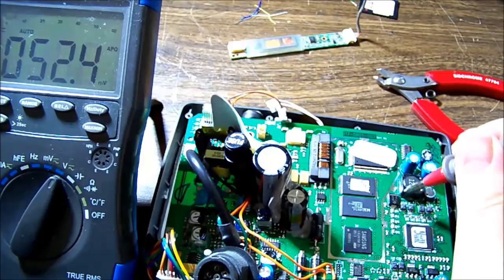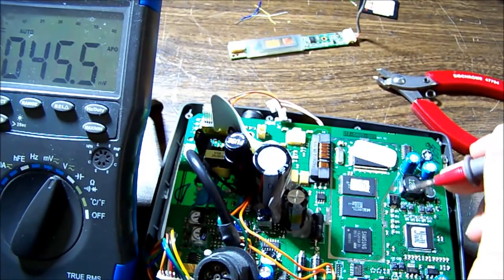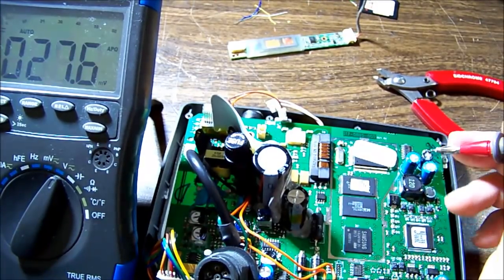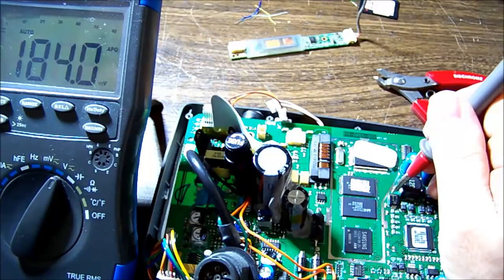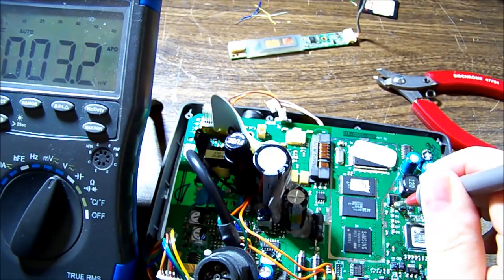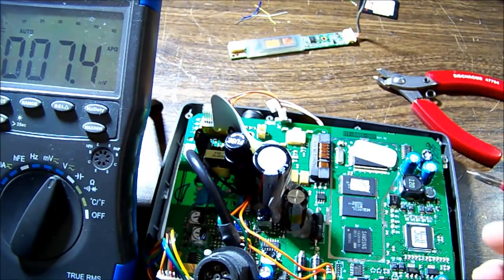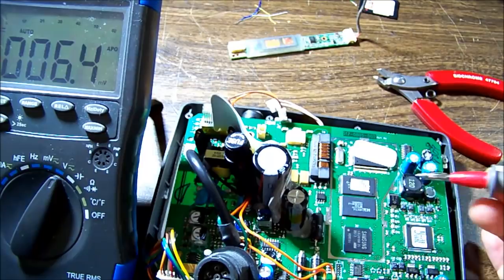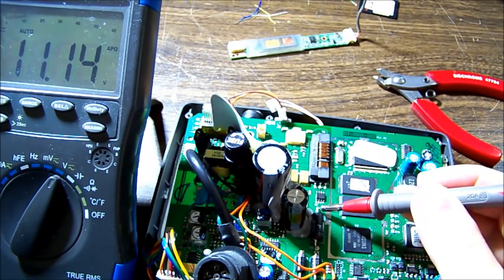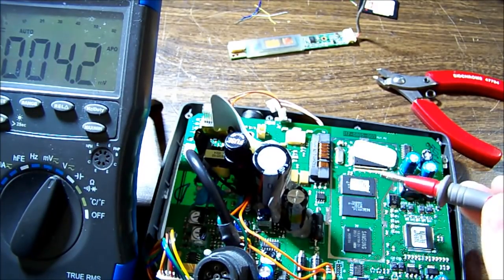Okay, I'm going to tap off the end of that diode. I am going to put the scope on it and make sure it's not the end of a switching inductor that has a whole lot of noise on it. I don't really need that to upset everything, but it's 5 volts there. If it is switching, it's probably, yeah. Okay, cool. So there's 5, and of course our 12 on the end of the inductor there, which is 11. My meter scale is a bit off.